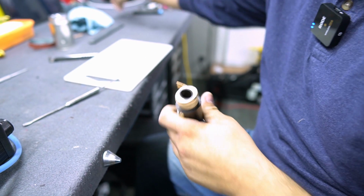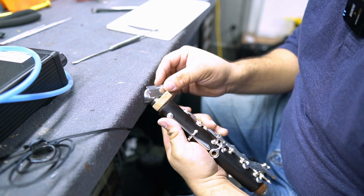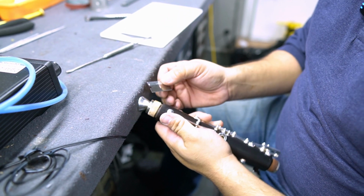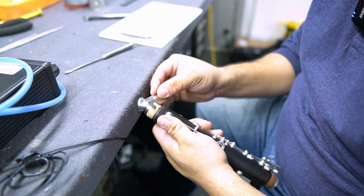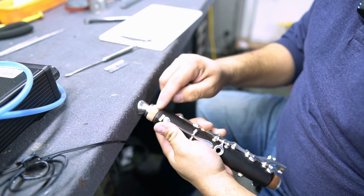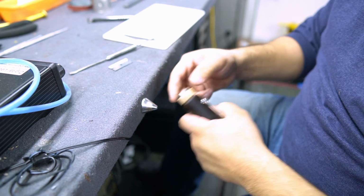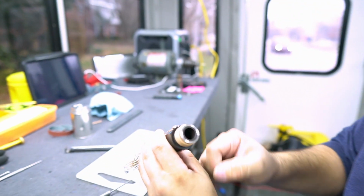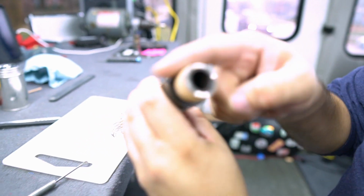So what we can do is take a razor blade, nice and sharp, a fresh one, and cut it off. You don't have to cut it off all at the same time, but just notch it down, and then we can take off some more. It's where it's meeting, so we'll leave it there. Now we have this little hump from where they're overlapping. So we'll sand that down.